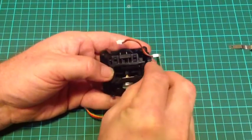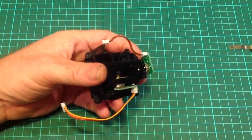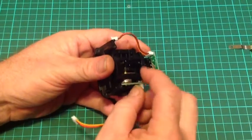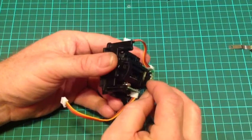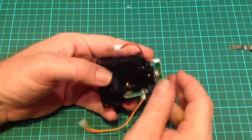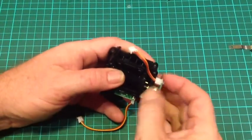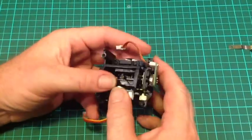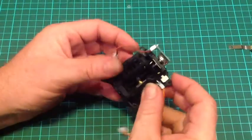It's a little tricky, like it was to get out, so there's a quick edit of the video — I've got this piece fitted in correctly now. As I said, the small raised bit is towards the inside. Once you've got it in there, you just slide that back down to lock the potentiometer in place. Okay, so on to the final stages now of the self-centering.